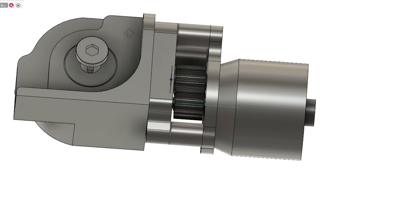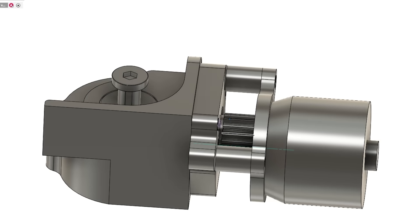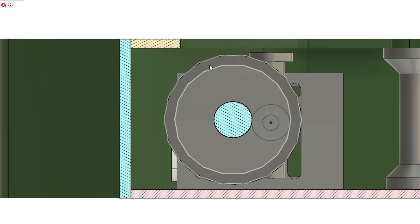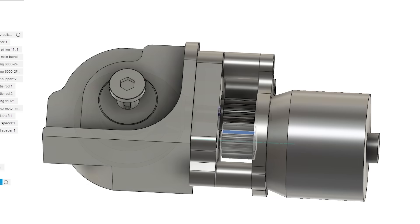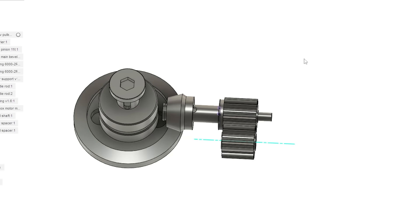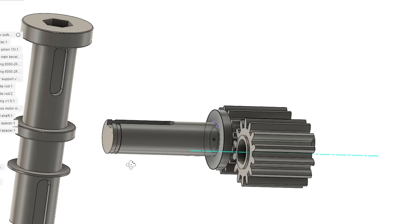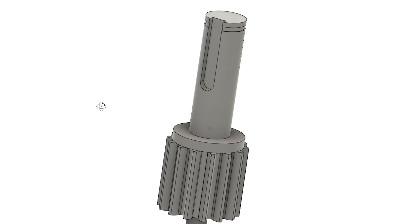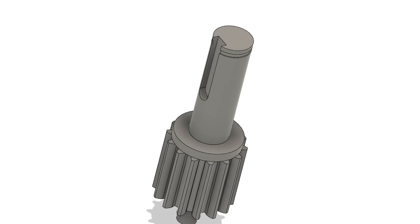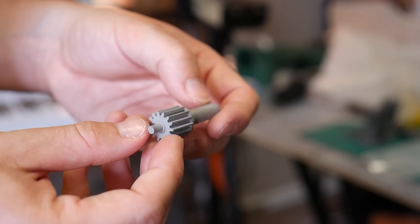It looks mega funky, but bear with me, I have my reasons. The 50-45 brushless outrunner is plenty powerful, but it's actually just a little bit too large in diameter to sit perfectly in line with the existing gearbox. So I opted to couple it via a one-to-one spur gear train. This assembly mates to the existing gearbox through a custom adapter plate, and the real secret sauce is this component: combining the spur gear with shaft and keyway, because it's 3D printed out of tool steel. Bet you didn't know that was possible.